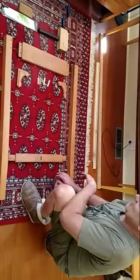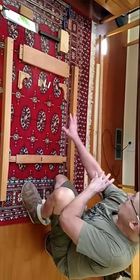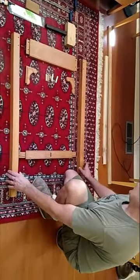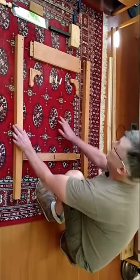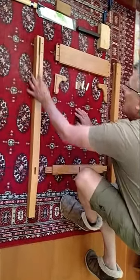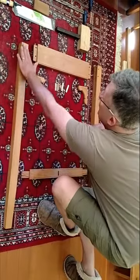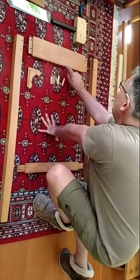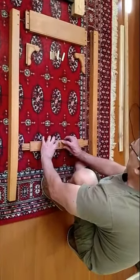In the assembly process, you're going to have a left leg assembly package and a right leg assembly package. This is the left leg assembly package. Imagine you're standing, looking at the desk from the left side — this is what you're visually going to see. So each leg, you should see no mortise joints on the front or on the outside. So this is properly oriented. The apron bottom will have the bead, and the cross stretchers will have beads on both sides.